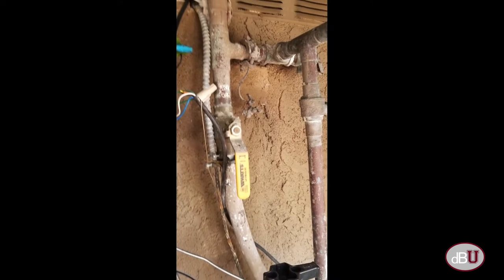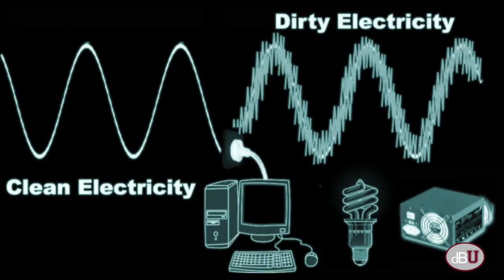From there we walked around the house and measured different things. Appliances, computers, lighting, even the suspect transformer. But nothing ever got over 45. I had asked the guy to explain to me what was going on and he said, "Your noise isn't coming from us. It's coming from your neighbors." It took me a second to think about that. I had wondered before if it was possible for my neighbors to backfeed crap into my ground plane. Now I knew they could. He wasn't waving his magic wand at my lawn. He was measuring the EMI coming into my water main.